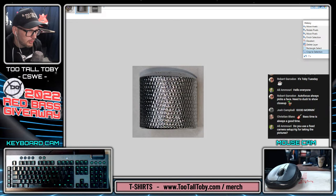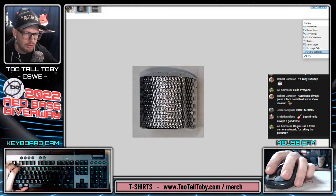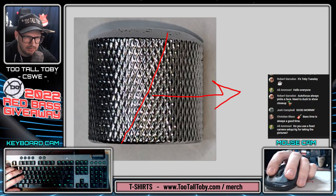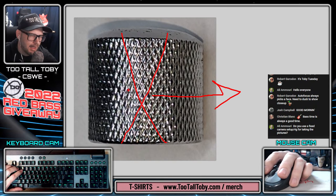Okay, so when we're doing knurling, basically what we're looking at is a cut sweep that is being cut in a helix and then patterned. Whenever you're doing knurling on a round or cylindrical part, that's what you're really looking at. So you've got your helical sweep coming up through here. That's your helix, and that is cut to give you the first groove, and then it's patterned all the way around in a circular pattern.